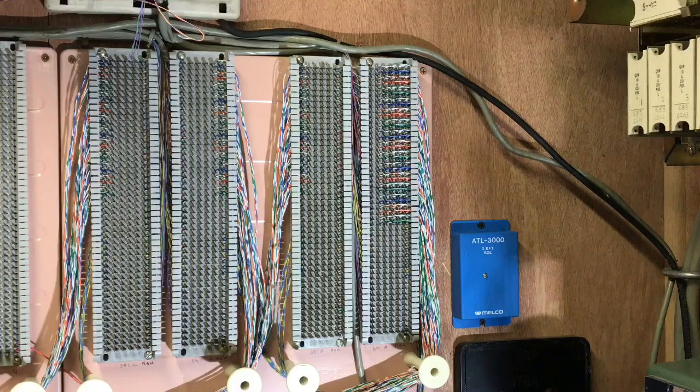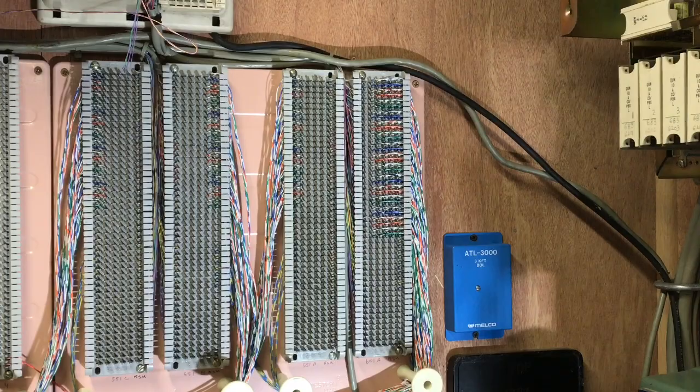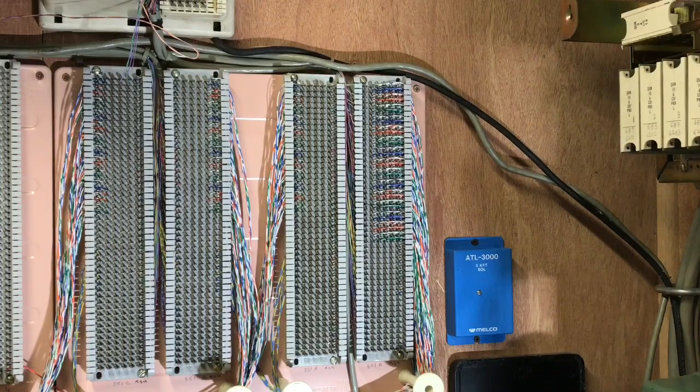The design of the ITT K601 did not lend well to more than two phones actually wired into the KSU. I've seen installations where people had three or four phones wired into them, and because they run out of lugs to tie cables to, they would just strip the wire and wrap it around the lugs or use Scotch-lock connectors. Either way, it was a disaster. Wiring them out on a 25-pair cable to their own dedicated block then makes cross-connecting wiring and adding other phones much simpler.